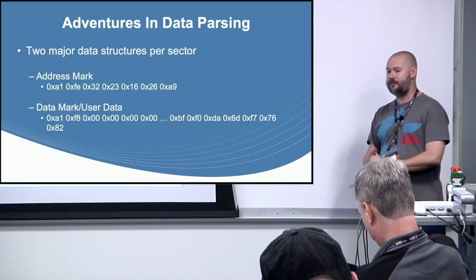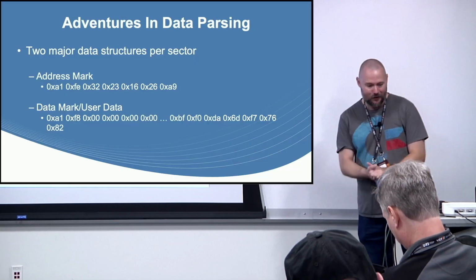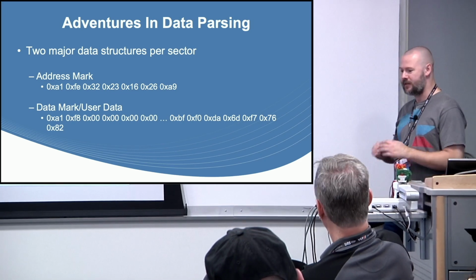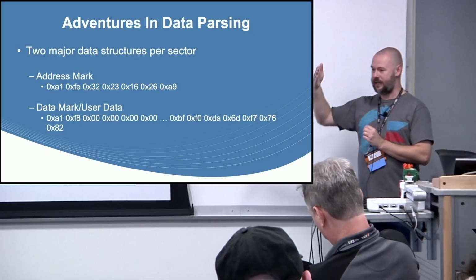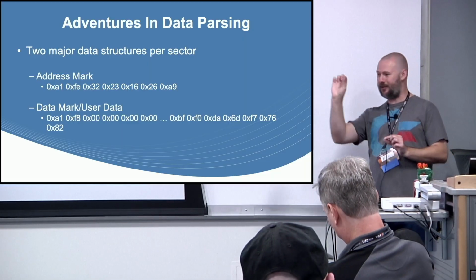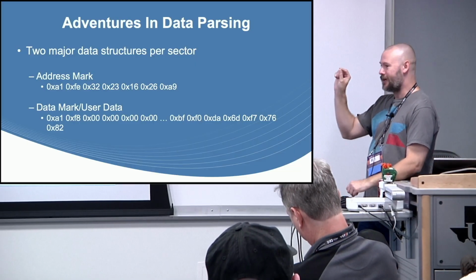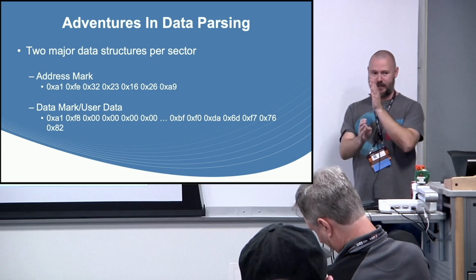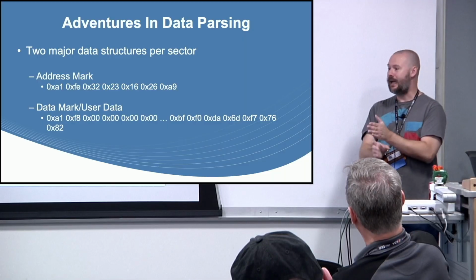Well, that's where you start getting into a value called sector interleave, which is something else they threw at us back in the day. Thankfully, that's not unique to RLL. Sector interleave was a way that they would toy with increasing performance. So on the disk, there is a separate area where they have a mark called an index mark. If you're familiar, anyone who's played with the 5 1/4 inch floppies, that little hole off to the side, or in some cases 10 of them for certain disks. That little index mark, you'll notice as the disk goes around, it'll do a hole once per rotation. The hard drive has the same concept. As soon as it hits that index mark, it knows it should start reading the first sector of data from that track and go around.